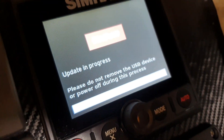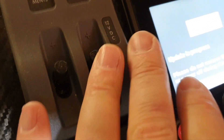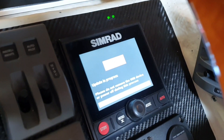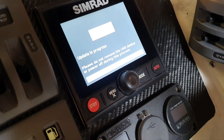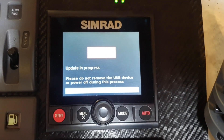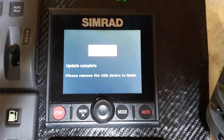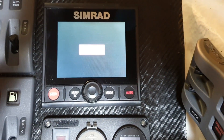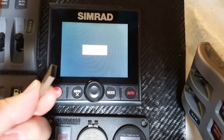I found the new software and I'll explain what happened. I plugged in the USB when everything was off, then I switched on the autopilot and MIA — meaning the controller and the computer. When I powered it on, the upgrade process began automatically. That is actually one way to do it. We definitely updated the controller again this way — don't do that. If it's already updated, either remove the file or don't power it on after inserting the USB, because you don't need to update it again.